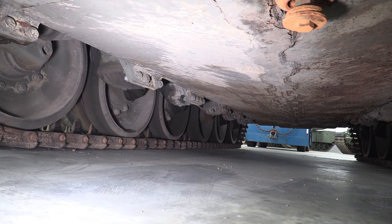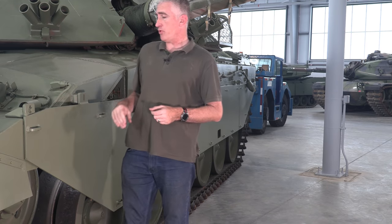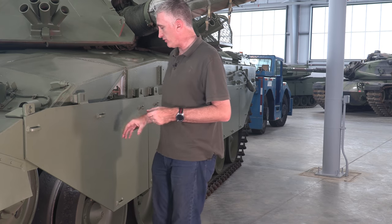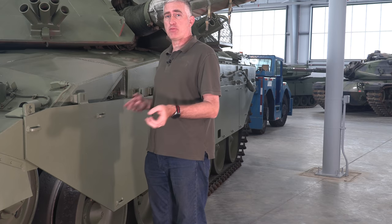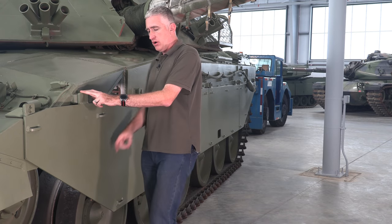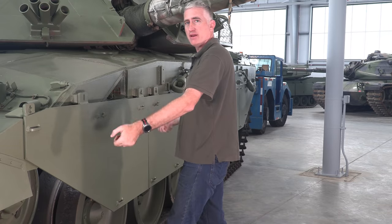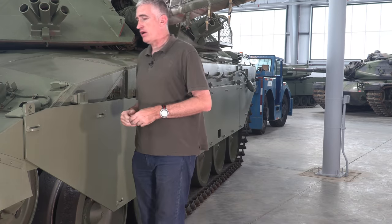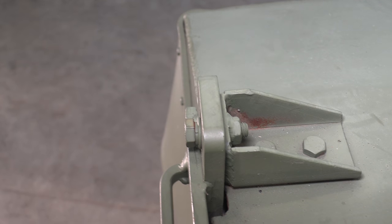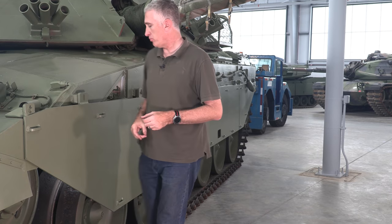The little bulge at the bottom is a sump for lubrication oil. Coming upwards, the side skirting is apparently aluminum — my magnet doesn't hold onto it — which makes sense considering you're supposed to take it on and off for maintenance relatively frequently. It's held in place by bolts at the top, and underneath there's just a hook and latch onto the support arm. You undo the bolts, pull it out a bit, then up and set it aside. The nut for this bolt is welded in place — neat idea, since it means one less thing to go missing when you pull the bolt out.